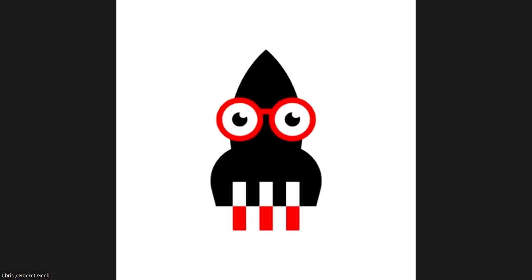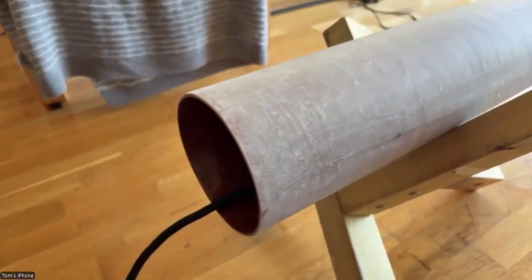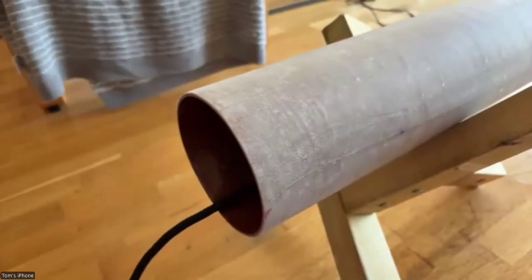And you said you put one wrap of fiberglass on this? Sorry, we put 1 millimeter of fiberglass, so 5 wraps on it over 2 millimeter acrylic. 5 wraps, 1 mil. Okay. Yeah, thank you.